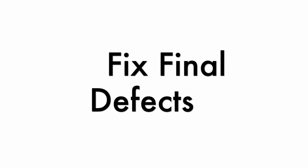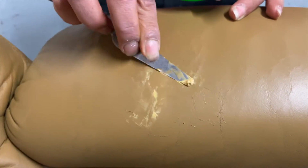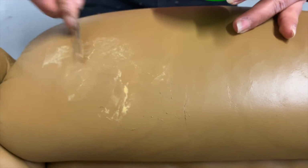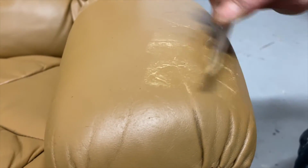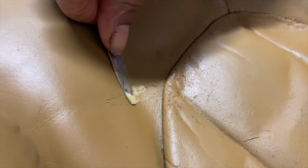As we applied the paint, we noticed certain areas that still needed some more filler, so we repeated the filling process here. There was also one area where the ink stain had migrated through the paint, so we applied a special product called the COLOURLOCK blocker, which forms a barrier, and resprayed some paint. Finally, we lightly sanded the surface using 4000 grit sandpaper to remove roughness from spraying.